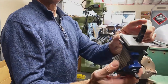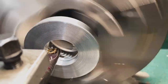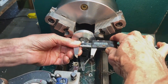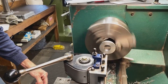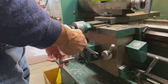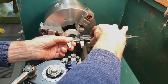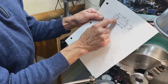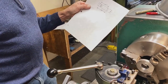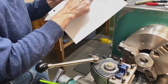I'm going to use a small boring bar here. I've got 114 thousandths to take off. You see how there's a step and the step has to be a certain depth. So if I set up the dial indicator and I move this dial here, when that needle comes to zero, I know that I've got the right depth.